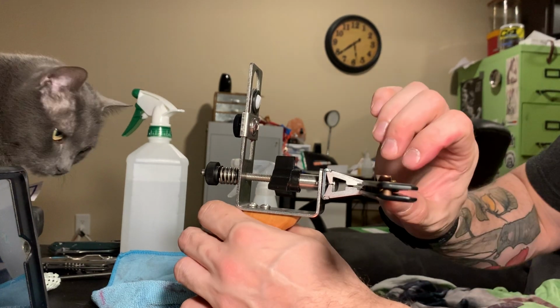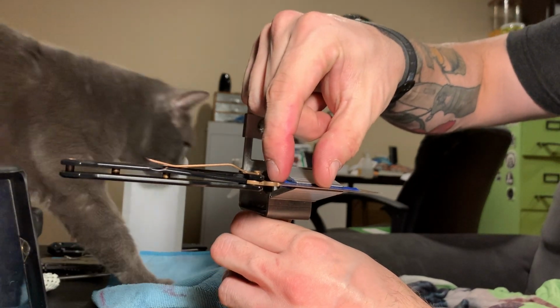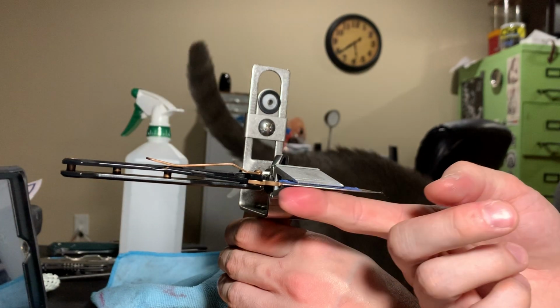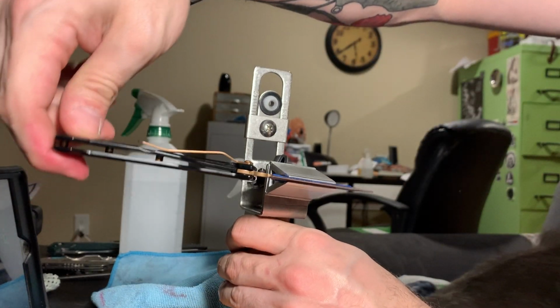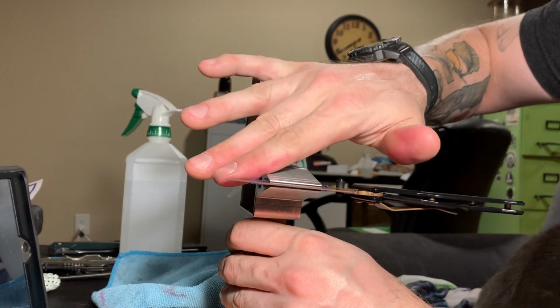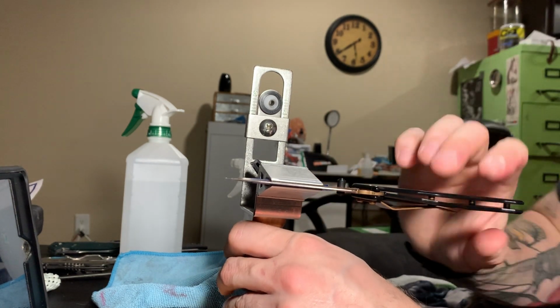And that got it. So I have removed the burr from this part of the blade that was giving me some issues, and I have now flipped it to this side. So we are good to do even lighter strokes alternating from side to side. I'm going to start on this side and remove the burr with very, very, very light strokes, continuing with the 140 grit.